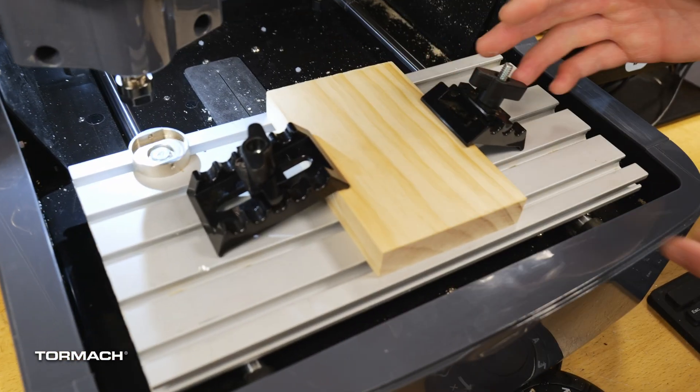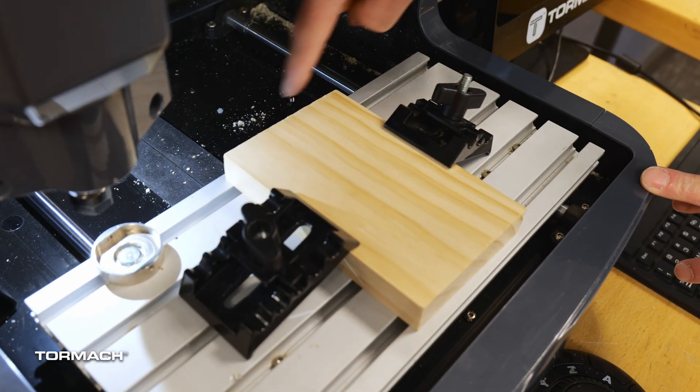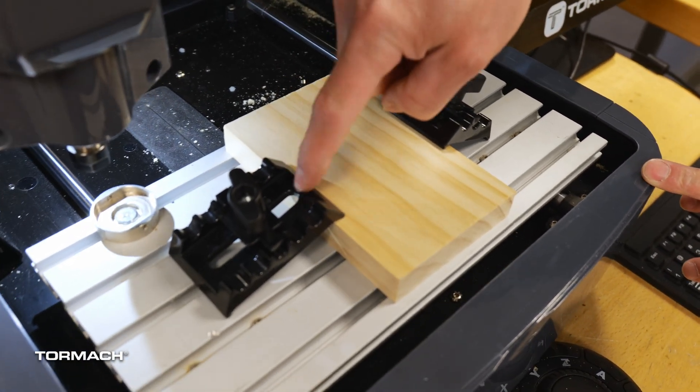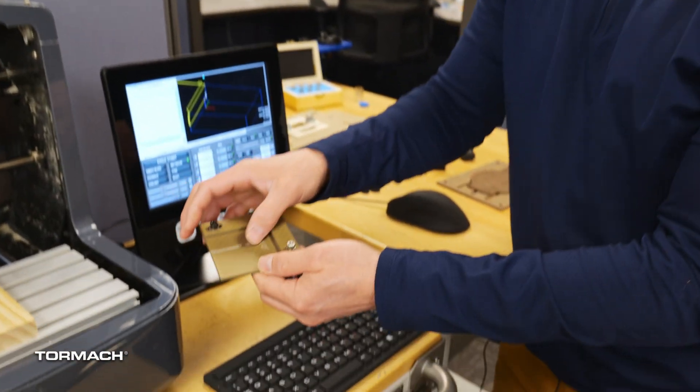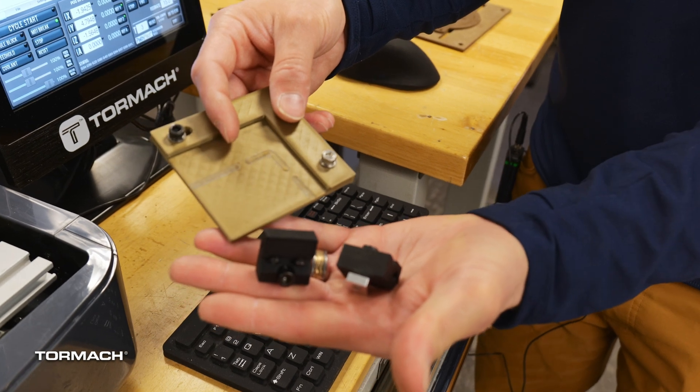Our tools are really sharp and should be able to withstand the pressures of moving back and forth. I just want to make sure that the material is not going to move — tighten it down pretty tight and we should be good. This is the tooling that comes with the XS-TEC. Every once in a while, I'll have a situation where I'm going to need to profile the stock material, and in which case these clamps are going to be in the way. This is another option — you can see I've already milled into this one. This is a 3D printed clamping set.